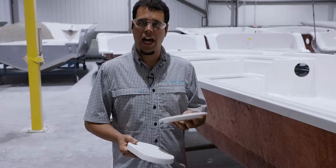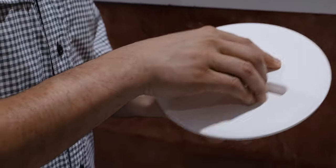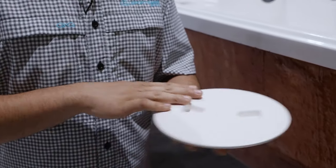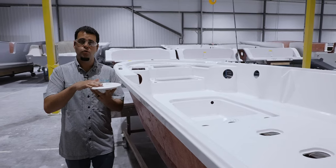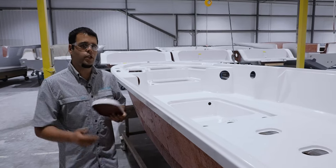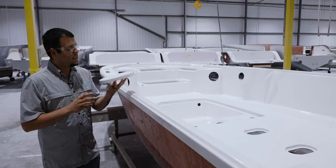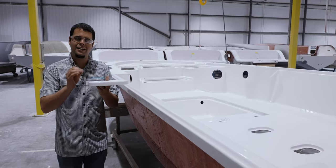Let's talk about one of the features on our decks. Many boats use a plastic pipe plate — you simply twist it open to gain access to important components. There are three main disadvantages: they're made of plastic, so the sun turns them yellow and they deteriorate over time; this deterioration also causes them to leak; and they leave a raised dome on your deck instead of a flush surface. To solve this, we use a fiberglass puck made of fiberglass and gel coat, just like the deck. The result is a completely flush deck with a silicone bead around it. If you ever need to gain access, you simply cut it out, giving us a high-quality finished deck with no differences in materials.